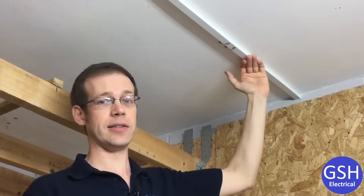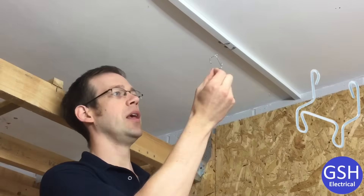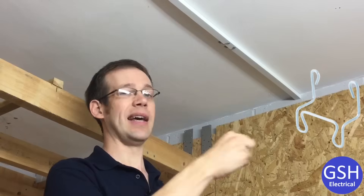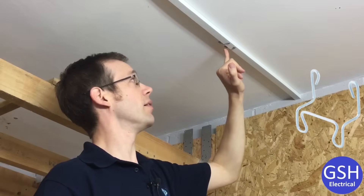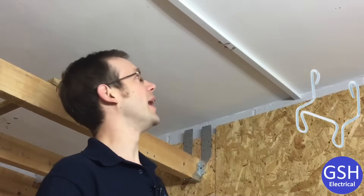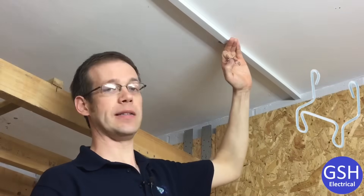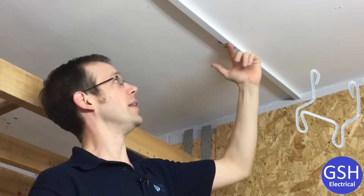Normally we would say no to retrospective application, but in this instance it's likely fire officers will look at situations like this and say it's a hazard that needs sorting out. Rather than removing miles of trunking lid to retrospectively fit the firefly clips, Firefly have produced a separate type of clip designed to fit over the outside of the trunking as a retrofit solution. This clip has been fixed directly to the structural fabric of the building using screws with no plastic element — no wall plug — so if fire breaks out there's nothing to melt and collapse. The clip simply fits over the trunking and holds it in place.